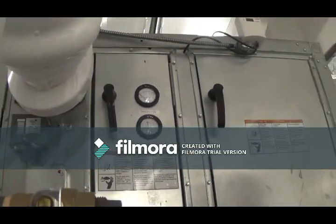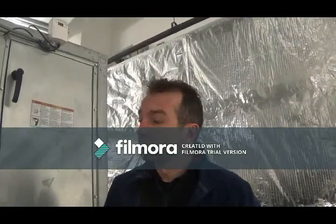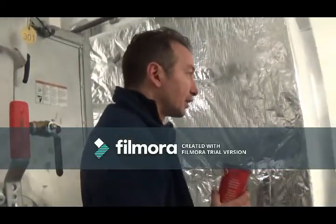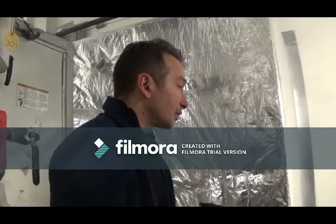Other than that, the variable speed, I don't know if automation's on this yet. We don't know. I think so. There is? Yeah, so Eagle Controls has controls of that, I guess, on here. As far as that, the motor will have to get greased and the bearings on there. That's something that we would do or the contractor would do. The belts, just listen for abnormal noise or vibration from the unit. If something doesn't sound right, something's going on.